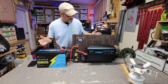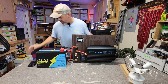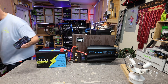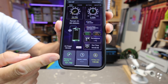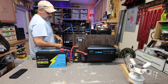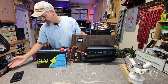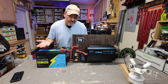We have hit low voltage disconnect. With all that said and done, I was able to get 101.79 amp hours out of that battery. I have had batteries that did squeeze out a few more amp hours, but I'm going to give this a pass since it's rated at 100 amp hours — we got about 102 amp hours out of it, so it is capable of producing at least 100 amp hours.